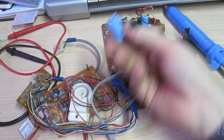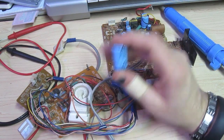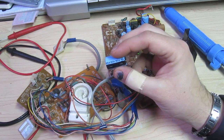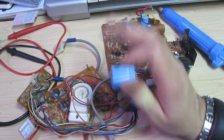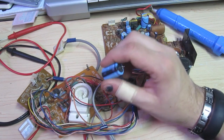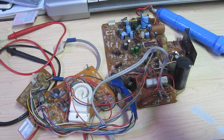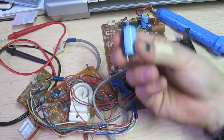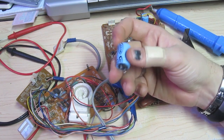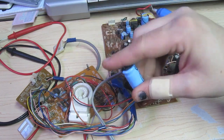So the capacitor is off, and this is a very common looking capacitor for an arcade monitor. You'll find these in old TVs and virtually all electronics. This particular one is a 160-volt, 100-microfarad capacitor. It comes in all shapes, sizes, and voltages. Basically — and this is my layman understanding — there's a conductive liquid inside these that holds a charge. I shouldn't even be handling it carelessly because you do risk a shock when touching a capacitor, especially a large one that can hold high amounts of voltage.